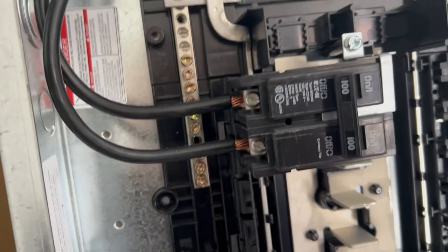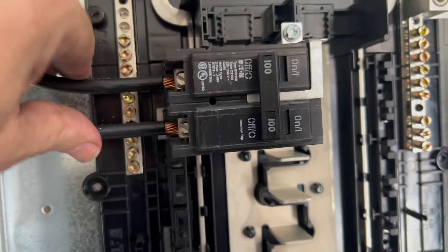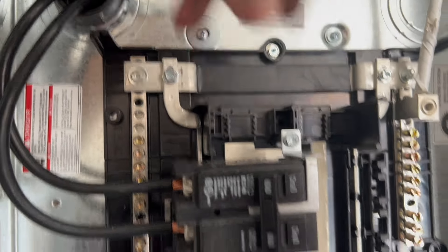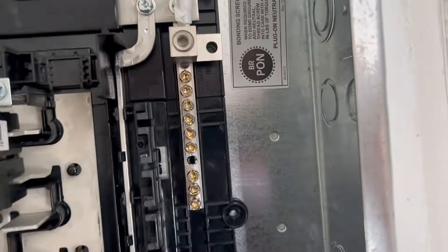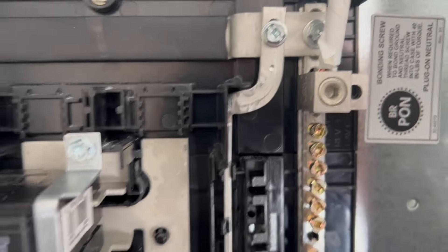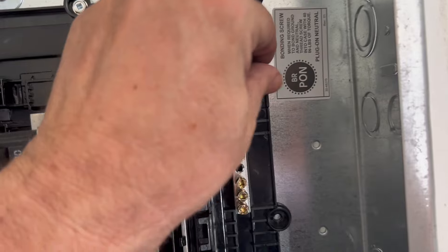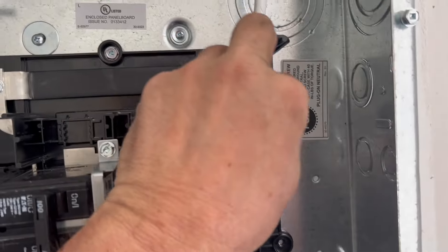Next step is to center my LB. Remember, it's an L, it's in the back — LB. From inside the connector, we're looking at 7 inches. These are weatherproof connectors because we're out in the weather. Next, cut that pipe and get myself indoors.